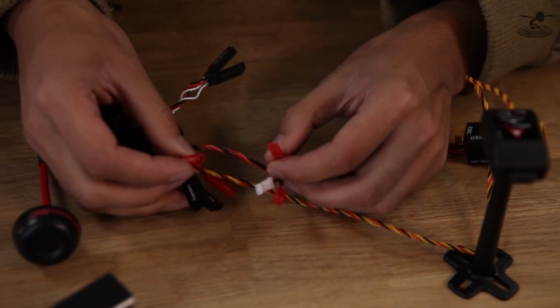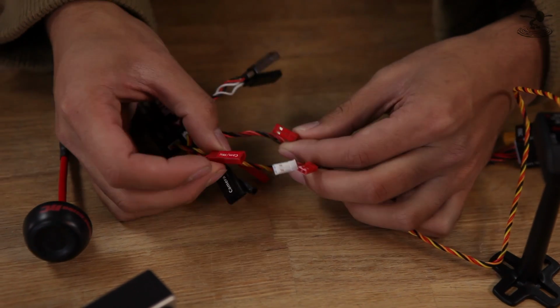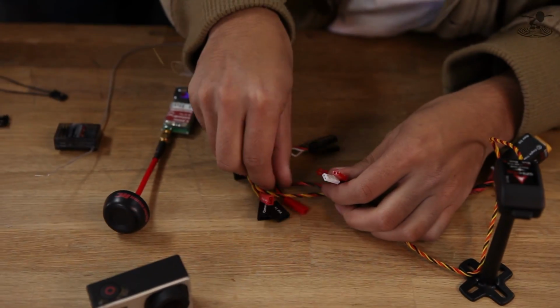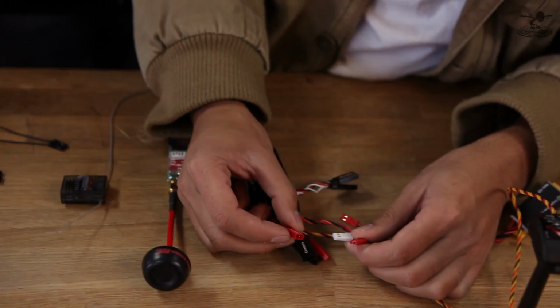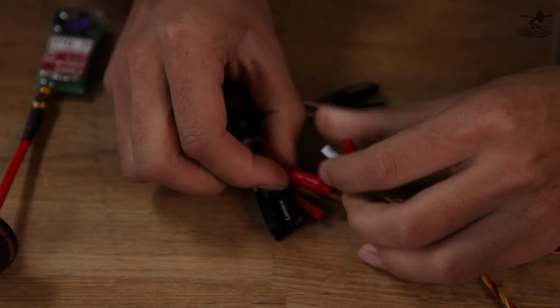It's self-powered, isn't it? So you have your camera, microphone, and you got the 12 volts, the 5 volts, and the 12 volts. But since we're not going to power the camera with that, we're just going to not even worry about plugging it in. Okay, what would you do if you had a board camera and say it was a 12-volt camera? How would you hook that up? We take one of the 12-volt red wires and plug it into the camera mic. So the white one is 5-volt? Yep, the white one is 5 volts.